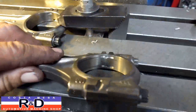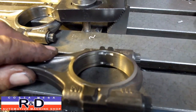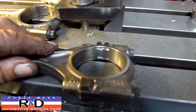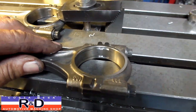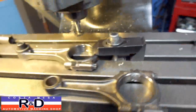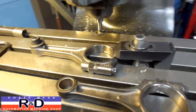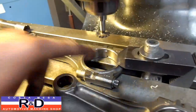What we're going to do is machine these so we have the tang that goes from side to side on both halves of the rod. This will be just fine on the crankshaft when it's all said and done because when they tighten up everything will fit just right. We've got the part held down with a bolt and a toe clamp over here, and we're going to use a keyway cutter to cut the rest of the slot in here.